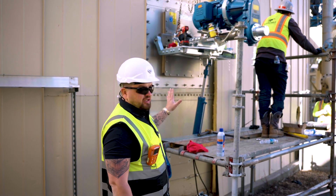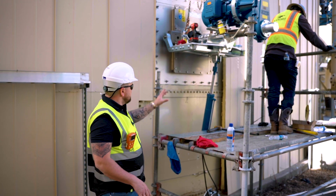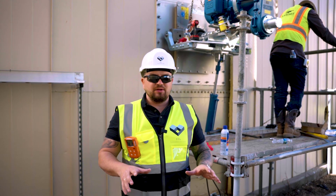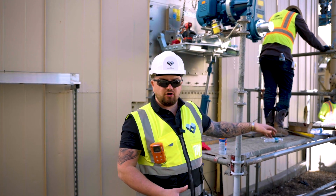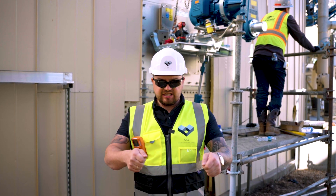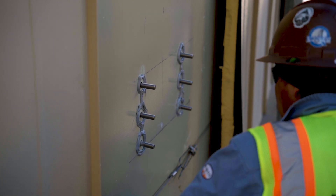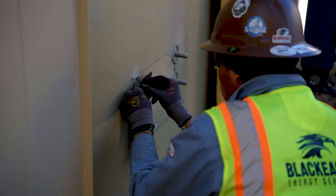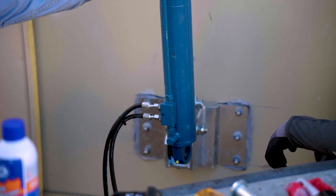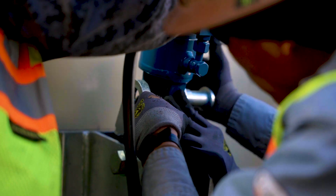As you can see, the mixer is already in — the bolts are secured and sealed, the frame is sealed, everything is properly sealed apart from the plate for the cylinder. The cylinder is now bolted in place. On the bottom we have to put a plate together and seal it down to the wall. After that, we need to put in the controller board for the cylinder and the pump so we can move it up and down, and we're going to install that on the side of the tank away from the mixer for easy access and control.